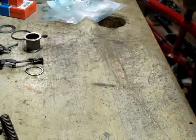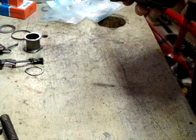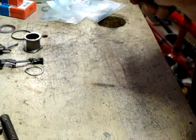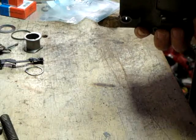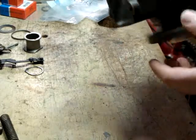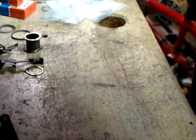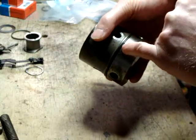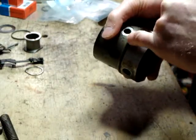I'm back to work on the pump. I've had plenty of time for the sleeve retainer to set up, and I feel confident it's going to hold that sleeve — or pilot tube as they call it — in there. There's a little residual I need to clean up, but other than that it looks fine. The next thing I'm going to do is reassemble the rotor. Right now I'm going to take a sharp pick and remove this O-ring so I don't mistakenly think I've already replaced it later.